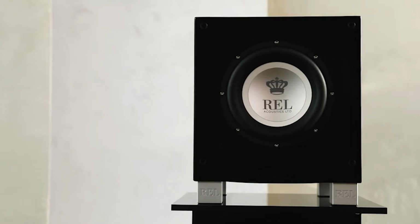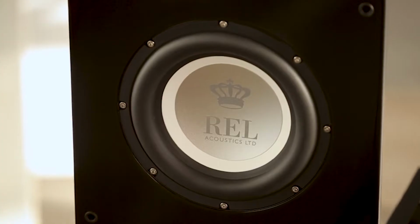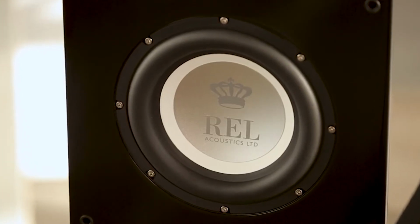This is a fantastic piece. With T7i, this is the first where we go with a forward-firing active driver and a down-firing 10. The forward-firing driver is extremely light. We actually went to the extent of removing the carbon black from the driver material because we found that it added about 7 grams of extra mass that we didn't need in there. So when you see this beautiful white color set off by the aluminum, while it looks very pretty, it was really done to save mass. Saving mass means it's quicker, it's more fluid, it's more musical, and that's extremely important to us.